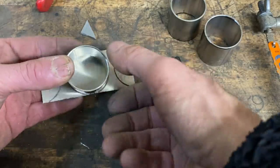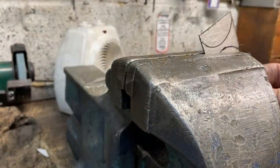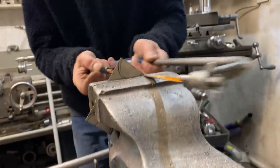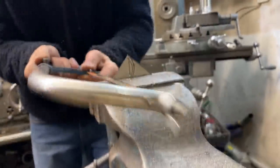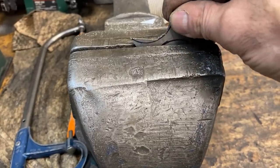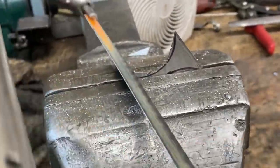The next thing I need to do is cut out the centre hole and the two side pieces. The easy way to do the centre is to weld that piece on first, put it in my lathe and then bore it out. I grip the piece of sheet stainless steel with my vice and use my hacksaw to cut along the edge — by cutting close to the jaw there's much less noise. I keep repositioning so I can cut out the very last piece of metal, then get my half round file and true it all up nicely so it fits onto the piece of tube.